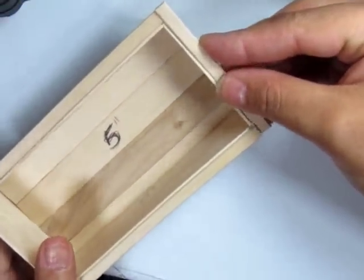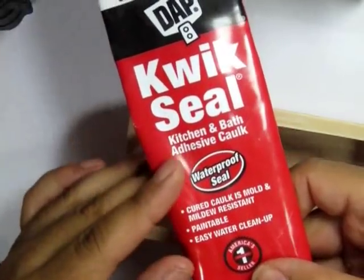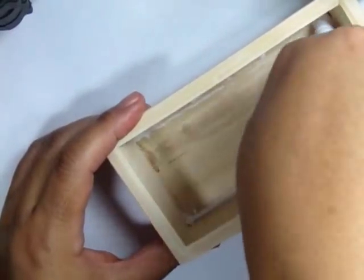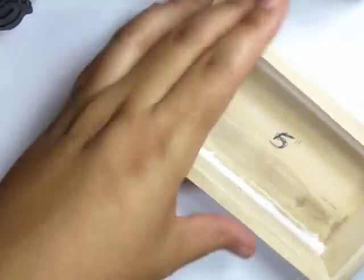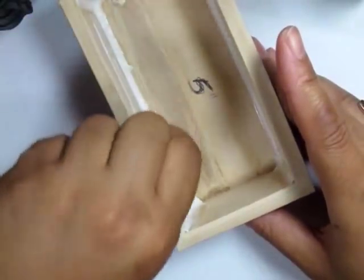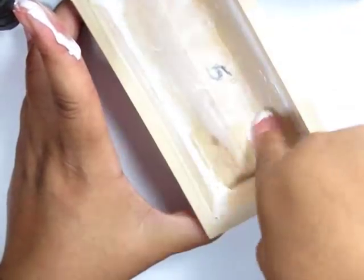I used wood filler to fill in any gaps, and after it dried and I sanded it, I went through with some silicone caulking. This is caulking medium you can find pretty much anywhere — Home Depot, Lowe's, even Walmart, which is where I got mine. This particular one dries clear from white, but some dry white, ecru, almond, or whatever other color you want. Just rub the caulking medium into all the creases on your tub and also on all the surfaces that might be exposed to water — that means all the walls.